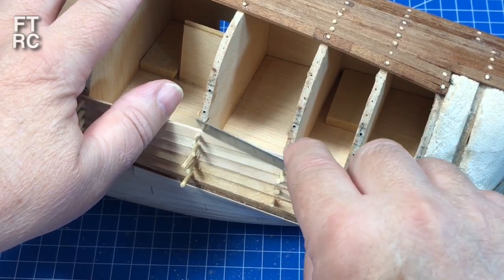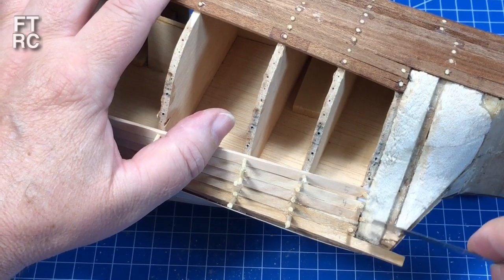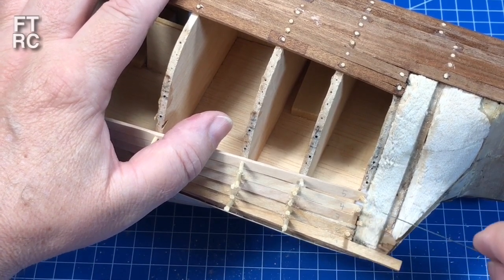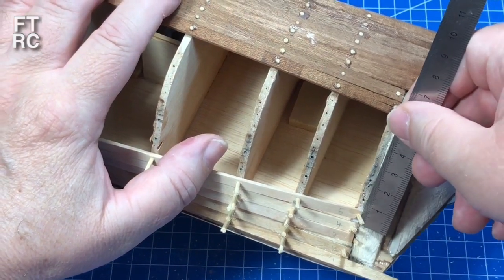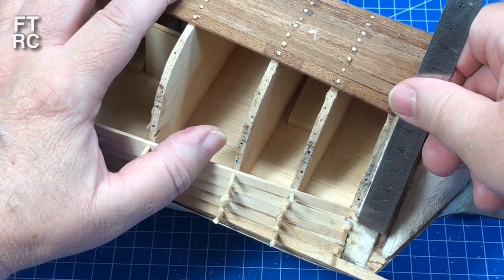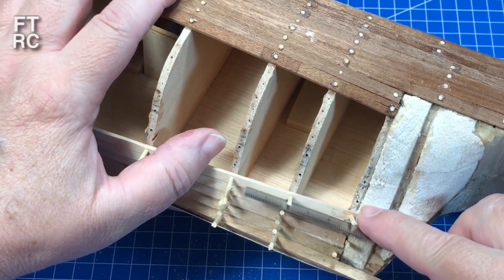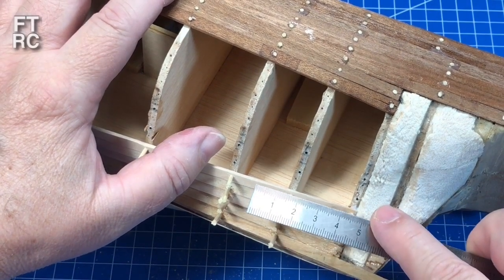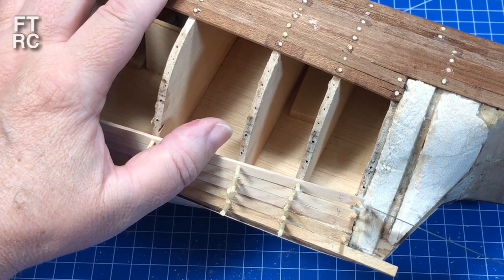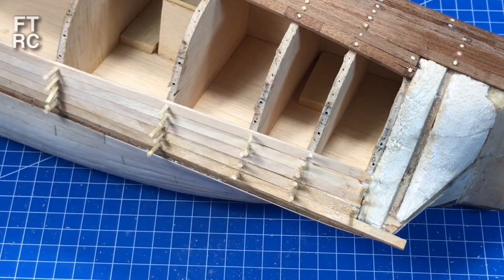I can already see that my holes aren't matching up to what I had pinned before. My tapering chart on the spreadsheet had told me these would be about 5.2 millimeters — bigger than my plank — so I'm going to need some wedges. I needed at least two millimeters there, and it looks about two millimeters consistently. Lengthwise it's going to go from there to there — about five and a half centimeters long, just over two millimeters wide. Best to make it bigger than you need because it's easier to chisel down than to add afterwards.